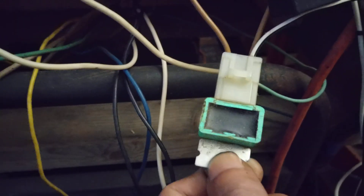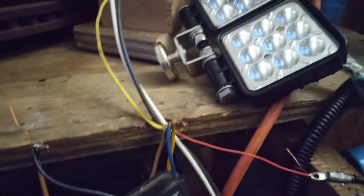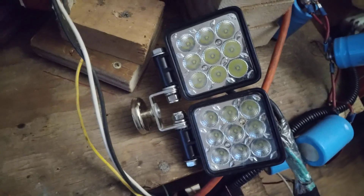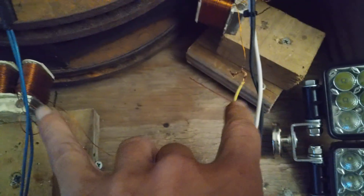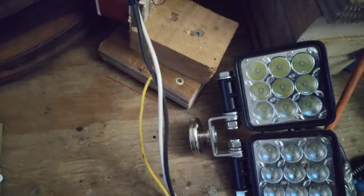The center coils are pickup coils that run through a strange rectifier I found on some kind of generator — it's like a three-wire setup. I'm jumping a ground off of one of the AC connections; it's probably the wrong hookup but it's working. The output of these coils goes to some LED car fog lights. I'm basically using them to collect the extra energy right now, and I can judge my RPMs by how bright they're getting.